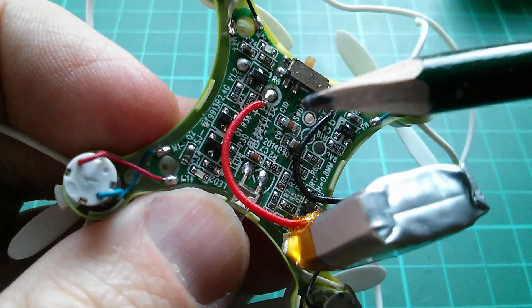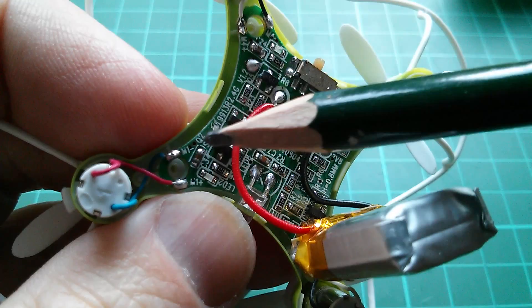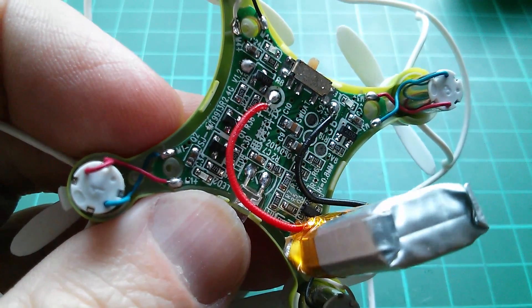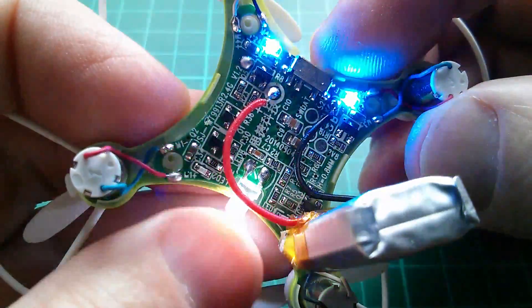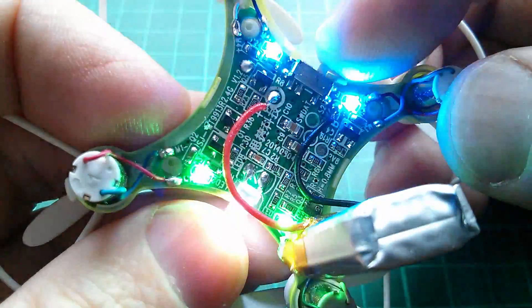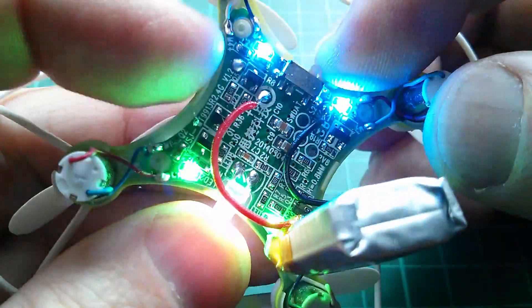There's not a lot on this side — just five transistors. I presume the four corner transistors are driving the motors in some sort of pulse width modulation type arrangement. You've got the white LED at the front to show where the front is, and then the green and blue LEDs flash — I think to tell you the battery is getting low while it's in flight.